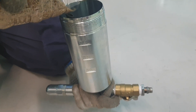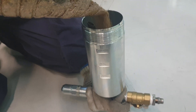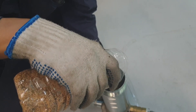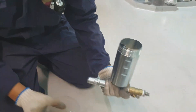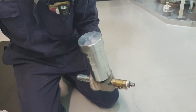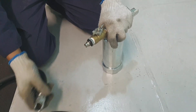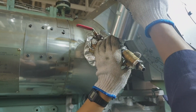We are using granulate which is 1.0 millimeter in size at an amount of 0.3 liter, as per manual instruction. The requirement for cleaning of the turbocharger is that the generator engine must be at least 75% load in maximum continuous rating — that is about 800 kilowatt. As you can see, the granulate is already inside the blow gun.